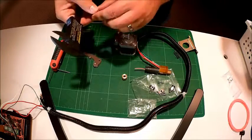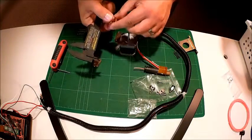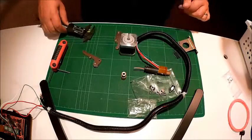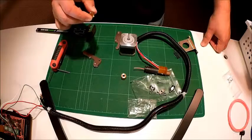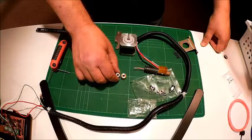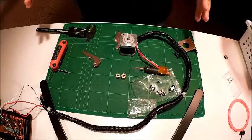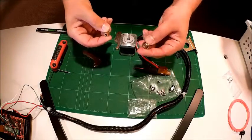While there does look to be more of a difference between the two, there's only a half a millimeter difference. Now half a millimeter is still quite a bit of difference, so we will probably end up having to change some of the settings inside the printer's firmware or in the slicing software to account for this difference between the two sizes. If you're going to make this change, it's very important before you assemble everything to make sure you understand what the difference is between the new and the old.